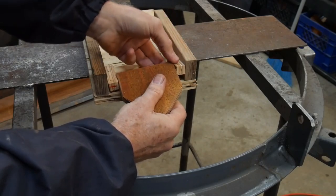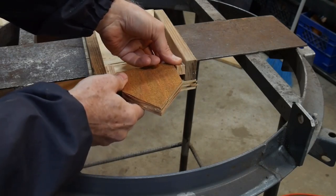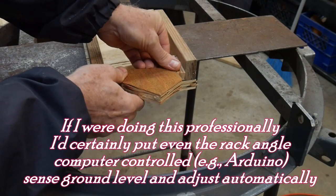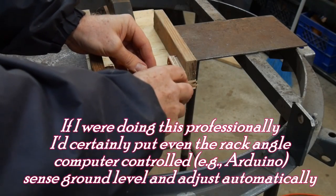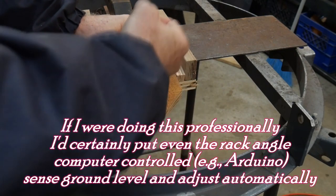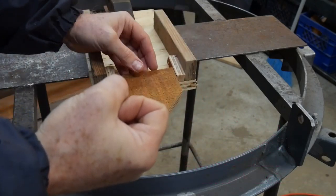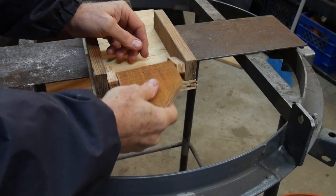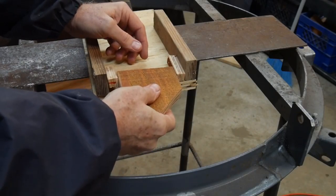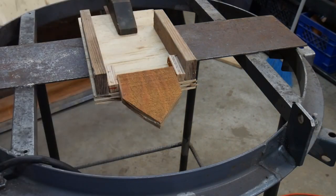As I played with this, I could hold one to a certain angular relationship and then if this other one was adjusted otherwise, it actually does seem to create the rack that I want. I should be able to get some adjustment – I don't need a lot from side to side. In certain situations, I can come up with a socket on my impact driver and just zzzit, zzzit – I can adjust either one and get exactly the angle I want if I'm having problems getting the snow off of one area. If it slopes too much and my tractor's not adjusting for it, I can make that adjustment. If you can spend a few minutes up front to save hours at the back end, yeah, it's well worth it.